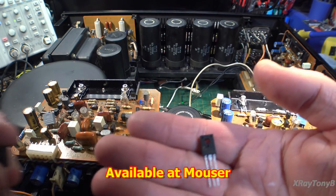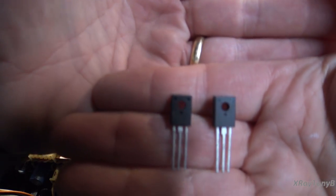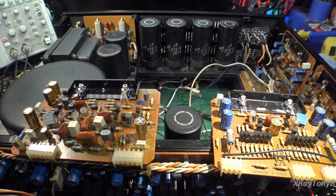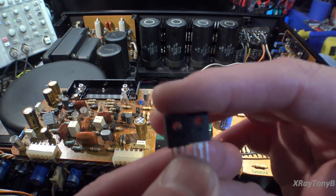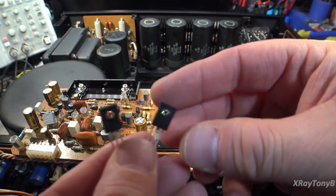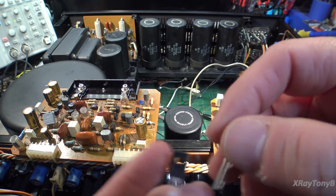These are made by Toshiba — they're in a kind of TO-202 or TO-126 type case. The part numbers are TTA004B and TTC004B — so TTA and TTC instead of 2SA and 2SC. They are complementary transistors, PNP and NPN, in a plastic case. So we can dispense with mica pads and directly mount these to the heat sink since they're totally insulated all the way around. However, that poses a problem — we used to pick up the collector from the heat sink tab on the original transistors.